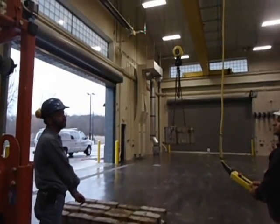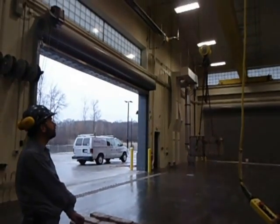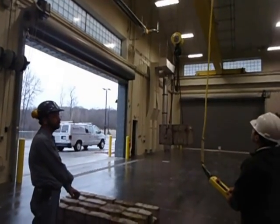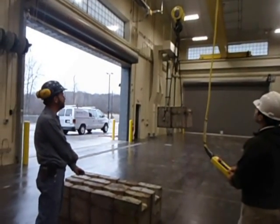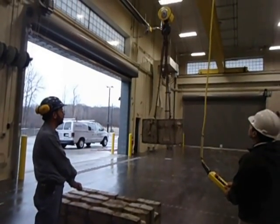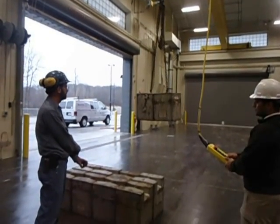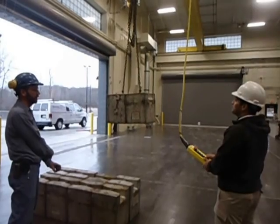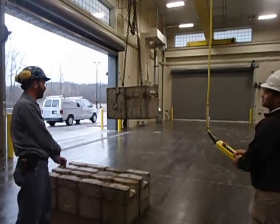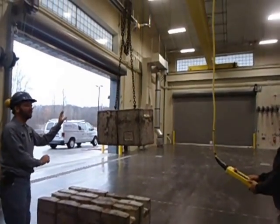It jumps and moves. So that hoist wire rope has got to maintain tension all the time. For the most part, the load block maintains enough tension. There are very few, most of them truck mounted, where the load block is not heavy enough. It is very smooth. I see you found out how to slow it down and not let it swing.